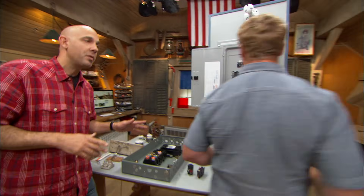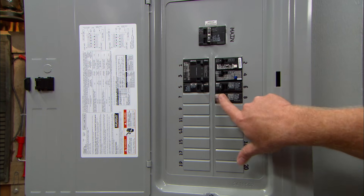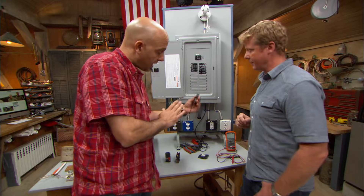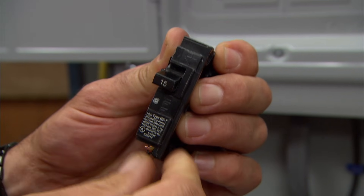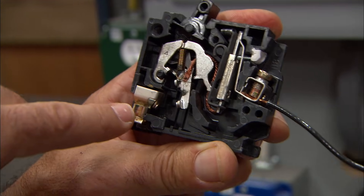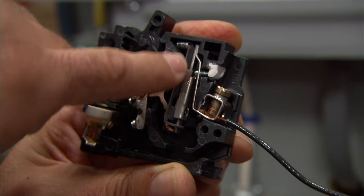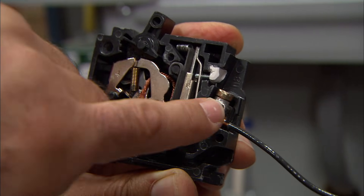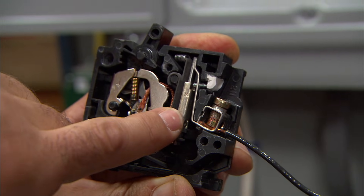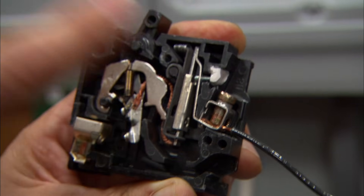Then the improvement upon that was a circuit breaker. This is what a lot of people have in their houses — these are actually the switches — and these are not disposable. They're resettable. I've brought a circuit breaker; this one's a 15 amp. I've removed the side panel to show you what happens inside. The electricity travels up through this, around this wire, and through this little thermomagnetic device, and it goes out to the wire itself. When the electricity heats up this thermal device here, it distorts and shuts the electricity off immediately, and you have no more electricity.